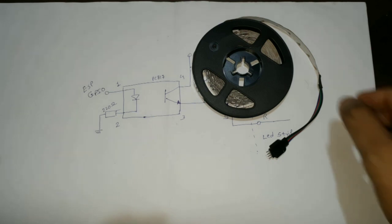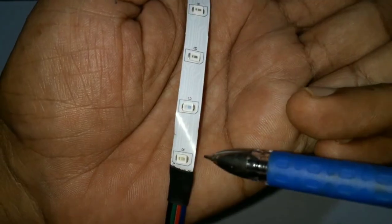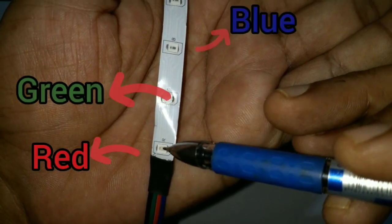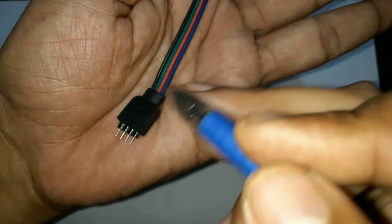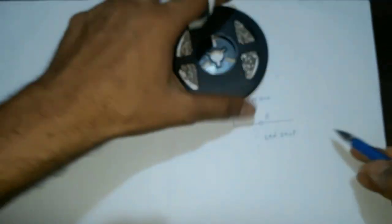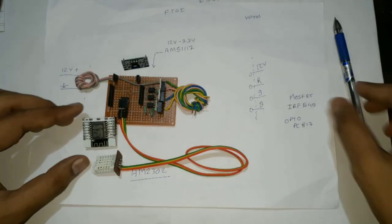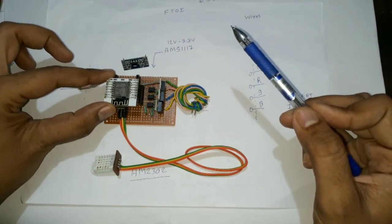This is the LED strip which is controlled by this module. In this LED strip there are three different LEDs — one for red, one for green, and one for blue. The black wire is for 12 volt, and the red, green, and blue wires are connected to the output source pins of our MOSFETs. I use female headers so that I can remove or replace the module anytime.